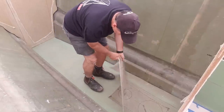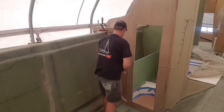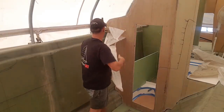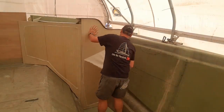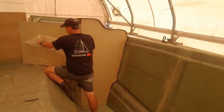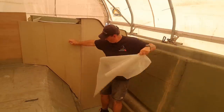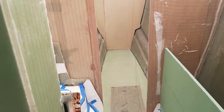The instant you peel it off, you realise how good your work is underneath. It's quite astonishing to see how flat and level you can make a fiberglass laminated resin surface just by using peel ply. Although it was designed for vacuum bagging, it certainly has its use in wet laminating where you can get an almost perfectly faired surface, almost ready for paint. It's an expensive material and can't be reused, but it does give you a superior finish every time.